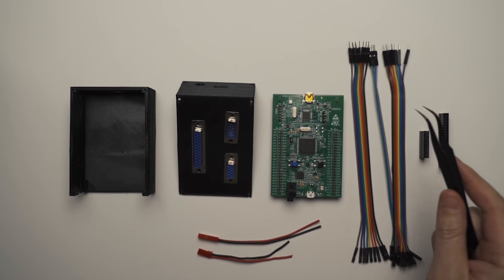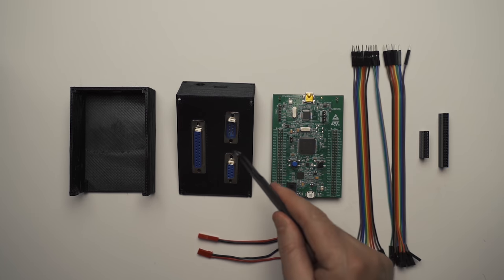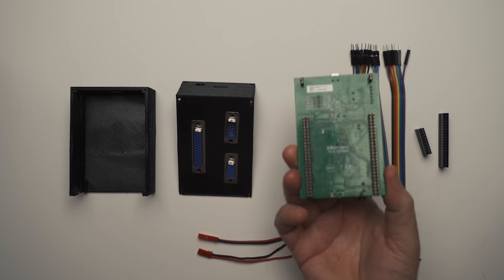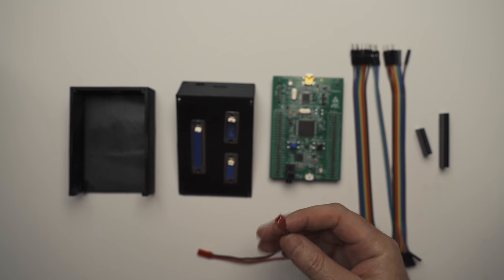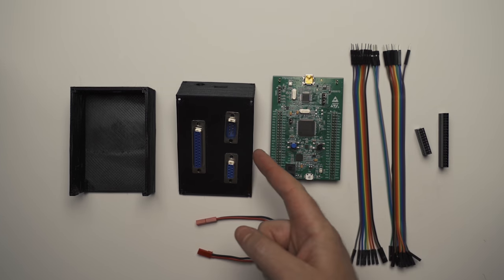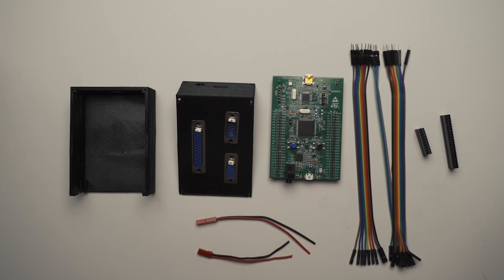Now I'm going to cut the ends off these jumper cables. I'm going to solder them to the DB connectors, then I'm going to pull the pins out of this female end, and I'm going to put them in a pin header like so, and then we'll probably plug them in upside down here on the board. Now I also have just a 2-pin connector that's going to be for the e-stop, so that'll just hang out the back and control the emergency stop button. Now probably just get soldering the DB25 connectors first, and then I'll work on the pinout for this later. So let's get soldering.